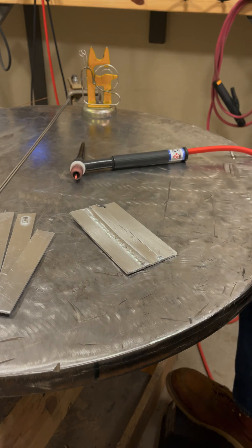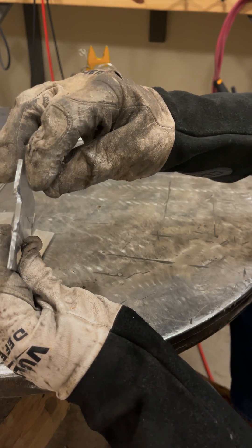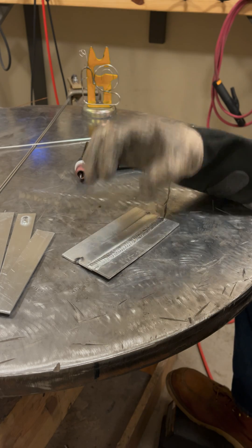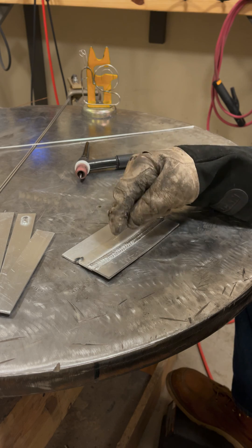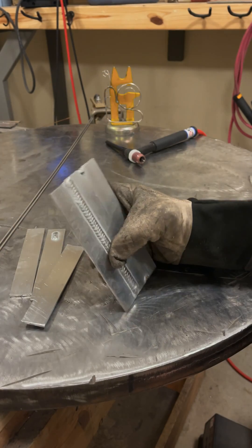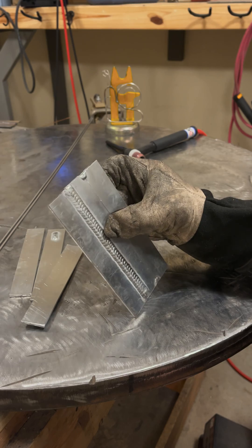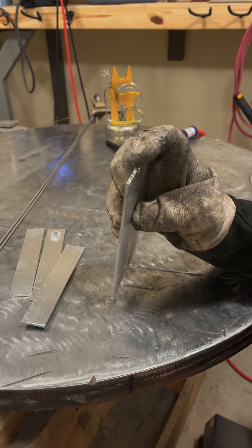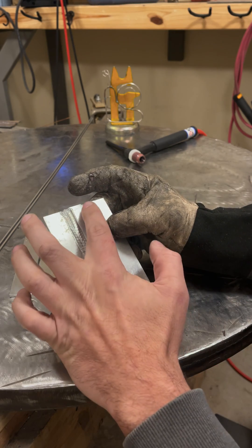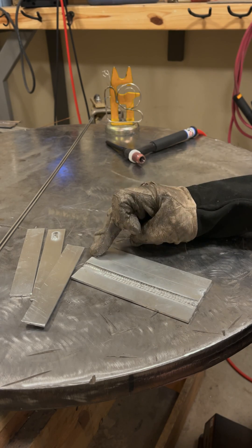I'm leaving this blooper in because that's the whole point of my channel — making mistakes and how to fix them. The plate was warped pretty bad and as soon as I liquefied that tack, the plates just popped. In the process of them popping, my tungsten got dipped and now I'm going to have to clean up the plates and re-grind the tungsten so it welds properly. After that little mistake, I re-tacked it: I cut the broken tack out, cleaned it up, bent the plates a little flatter, and re-tacked with a slightly stronger tack. What happened was the section was warped so much that as soon as the tack liquefied, it basically popped.